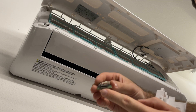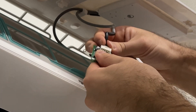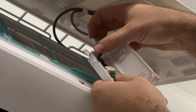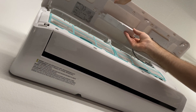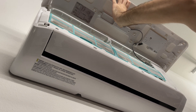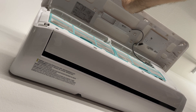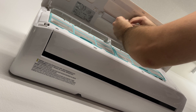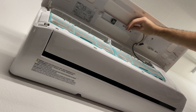Once you've cut the tabs out from the USB receiver, reattach the wires. Click it in there, line it up so it'll be snug, get the excess wire poked through, clasp it shut, and line it back up through the hole. Then take your screw and put it back in. At this point you can take your USB dongle ordered from SmartLight and just plug it in. You'll get a flash of blue light, and then let's go set this thing up.